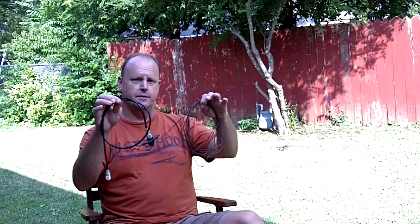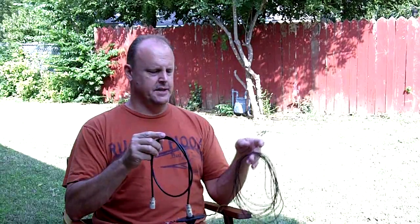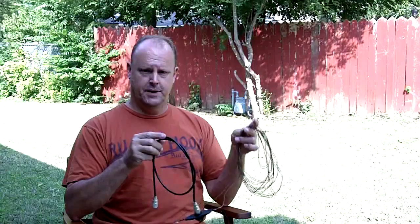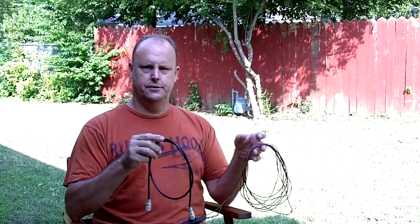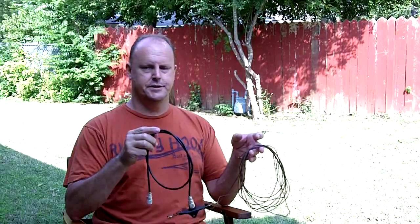I made 531 QSOs on sporadic E on 6 meters into over 200 grid squares this summer, 2010, with 20 feet of wire and about 3.5 feet of coax. This coax section is a 75 ohm matching section, and what that does is it converts the native impedance of the Delta loop itself, which is about 125 ohms, down to the 50 ohms that your transceiver expects.